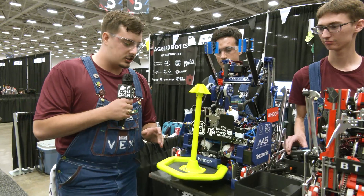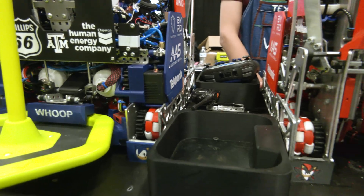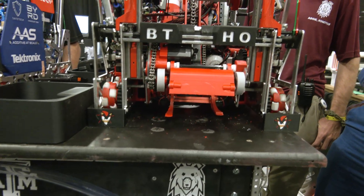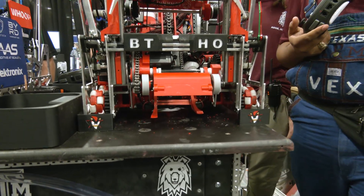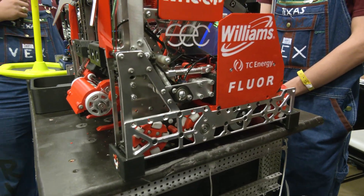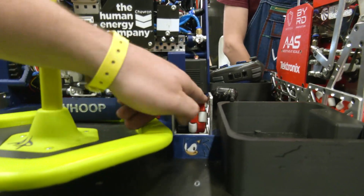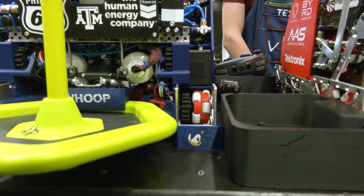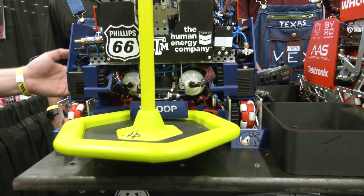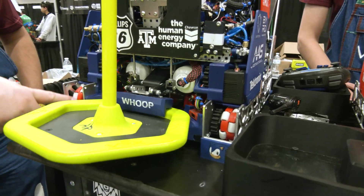Next, we go into our chassis, which we really specifically designed. Our dream this season was to do the Tier 3 climb, and to do that we had to develop a chassis with as much power as possible. We have a 10-motor drive on 2.5-inch completely custom Omni wheels, and it is all directed into a PTO shifter which completely disconnects it from the drivetrain into our lift. This is our drive motor right here — we can freely move our chassis. It's in lift mode right now, so when we're climbing and running into the ladder, we aren't stalling our motors and preventing us from climbing.